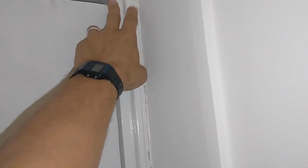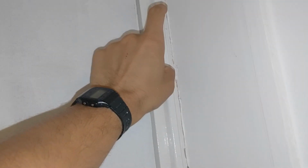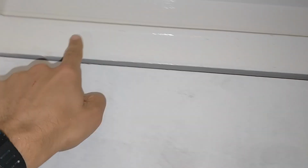to take the whole door off, and I'm going to fill all of this, so all of this gets hidden, and I'm going to put a new frame here. I'm not going to replicate this bit here, but I will replicate that there, so that you'll end up with a full frame the whole way down, and the door will sit inside of that, and that way when you open it, the door will sit flush up against here rather than at an angle, and it will look really nice. The other thing I'm going to do is reinstate 3 hinges.